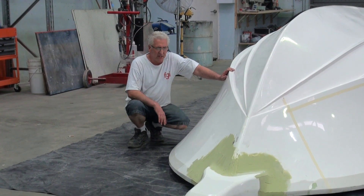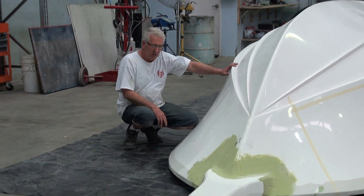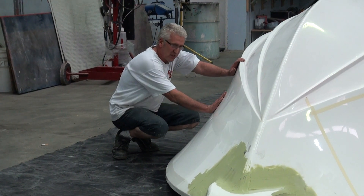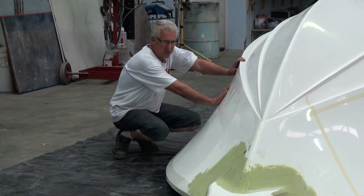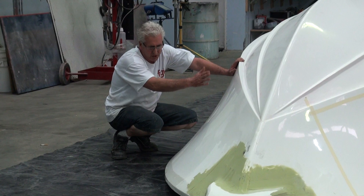What we're going to do today is mask up part of the side of the hull here and use these panels. We're going to wax this first and gel coat this side, then lay a fiberglass layup behind the gel coat, so it'll be a gel coat to gel coat face. These are going to be some internal panels.